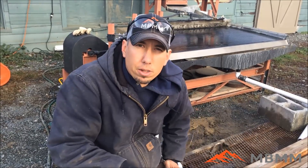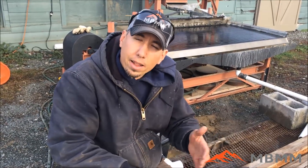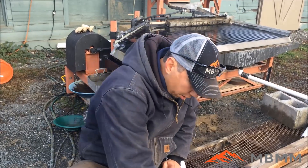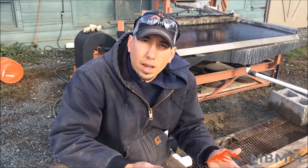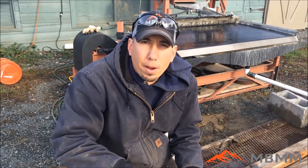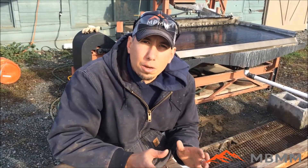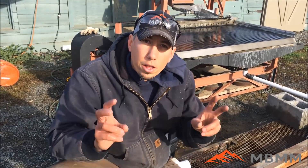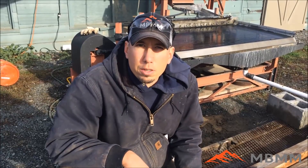Looking at how the table ran, there shouldn't be anything in the number four waste — it all got caught in the number three. I took a little bit of waste with the number three just to ensure good recovery. Thanks for watching. I think it went great and really proved how the shaker table can separate by density. The chrome we're separating is about 5.5 grams per cubic centimeter, so it's really not that dense compared to some of the heavier metals we've worked with, like gold and copper — yet even this lighter material separates really nicely on our shaker table. We'll see you on the next video.